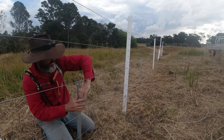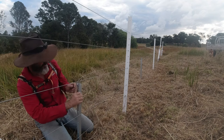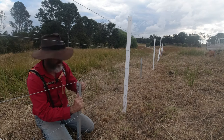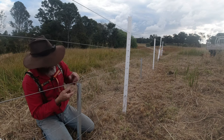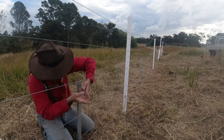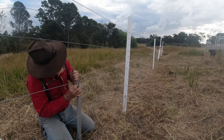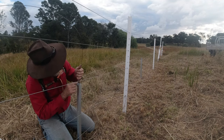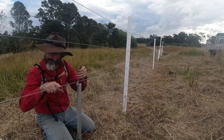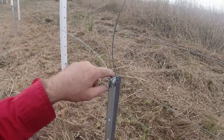This second wire I always find the hardest. Pull it tight first, holding it in position, then tighten the nut up nice and tight. Then shape it on the outside — you want to go up vertical around the loop, keeping it tight. Once I can see it's going to fit in there, I place it in, undo it, place it through, and then bend it down to 90 degrees to head off to the last stake.